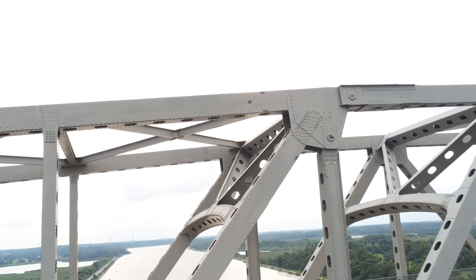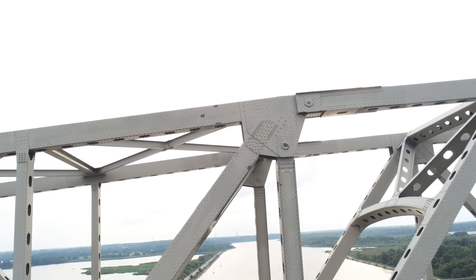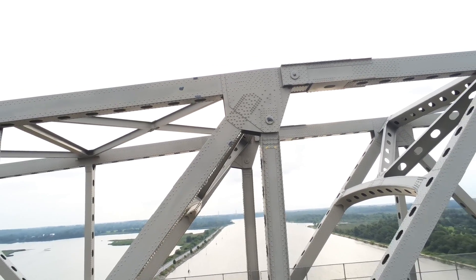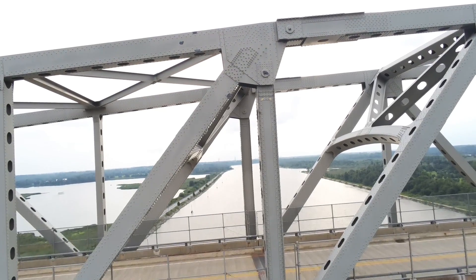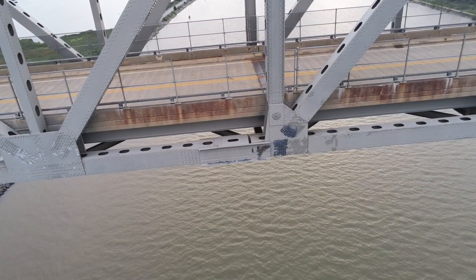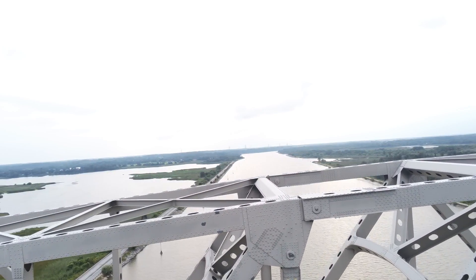So there's your joint — pretty joint. For any engineers on here, just think about that. It's a beautiful joint. There's a truss plate on one side, the gusset on one side, tying in the diagonal. And then the hanging member, which also has a joint at the bottom — pinned at the top, and all these are all pinned. It's beautiful.